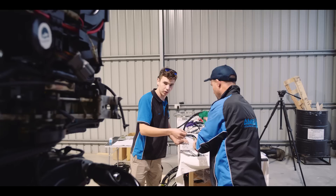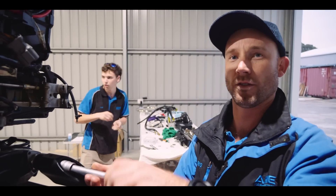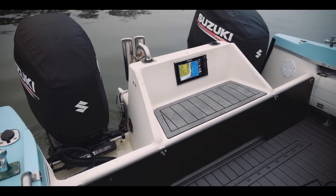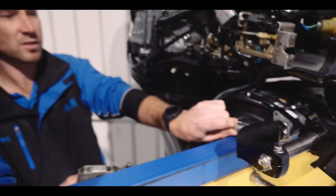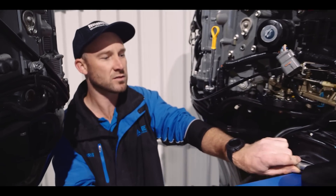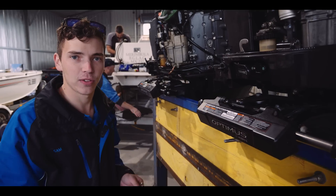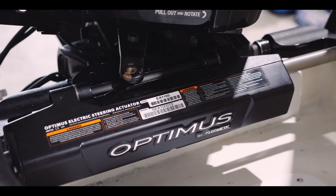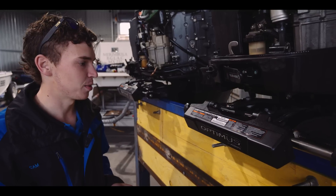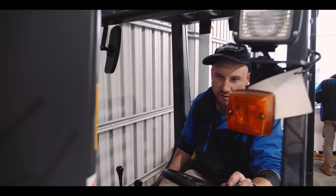With the install we've also replaced the main tilt shaft to suit the new bullhorns — that's basically where your outboard pivots when you're trimming and tilting. We made sure to fill that full of grease. The ram itself doesn't get greased, being an electronic unit with brushless motors — it's completely sealed, so we don't have to worry about mechanical maintenance. We've spent over 10,000 hours testing and designing this system, so I'm pretty confident it's going to be a good thing.